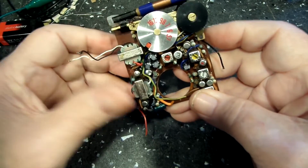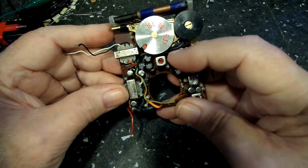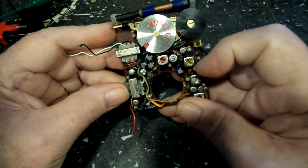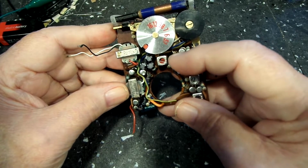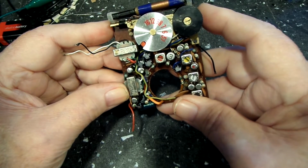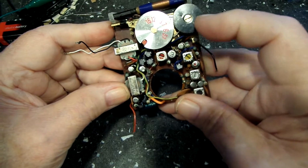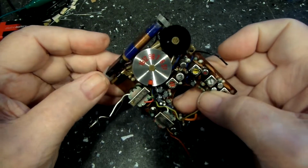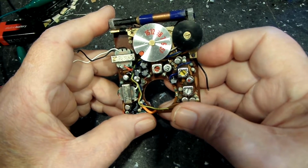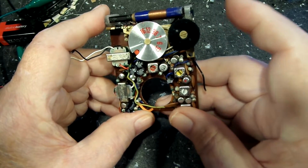And so, like I said, I have been watching a lot of J.P. Dillon and Shango videos. They work on a lot of these little transistor radios, and they have several with problems similar to this. And I've noticed that they have equal difficulty in finding a replacement transistor for these mixer oscillator transistors, converters, whatever you want to call them. They are picky, we'll just say that. And so what I have decided to do, and this is a long story to get to where we're going, is to take the transistor out of the brown radio, put it back in here, and make sure this works.